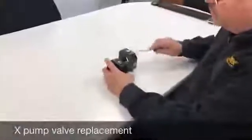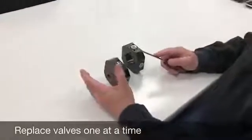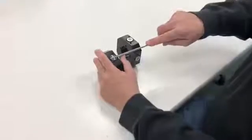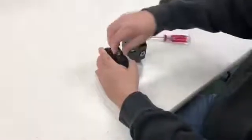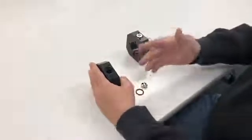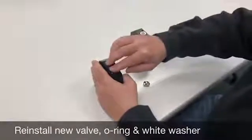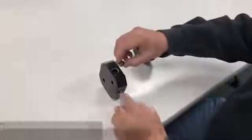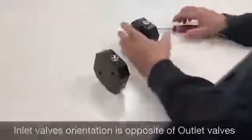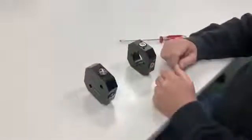To replace the valves on the X-pump, you have your intake manifold and your outlet manifold. Replace the valves one at a time so that you don't get the order wrong. Take your flat blade screwdriver, set it on the o-ring, and turn just a little bit and the valve will come out. Take out your valve, your o-ring, and your white washer. With the new parts from your kit, put your white washer back in, your rubber o-ring, and your valve — make sure the o-ring is oriented the same way. Just snap it in and you're good. Do the same thing with your outlet manifold, just the opposite direction, one at a time.